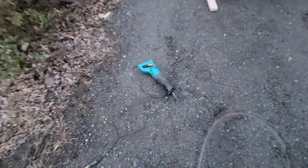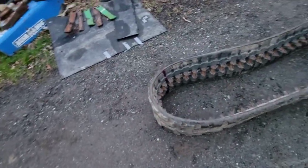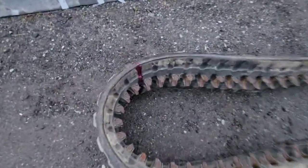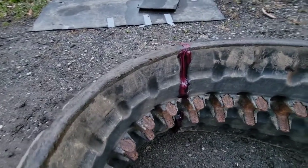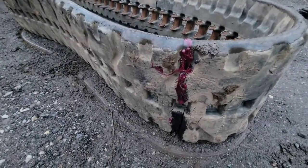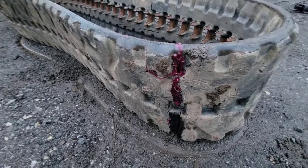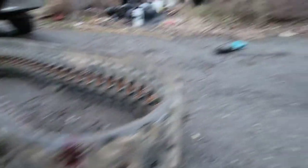To cut these things it's very easy — get yourself a sawzall, get yourself a metal blade. This one's 13 tooth per inch. Then get yourself some good old number two grease. You could probably use oil if you want. I just slather the grease where I'm going to make my cut on both sides. You can put it on the blade but it gets so hot that it just melts the grease right off or burns it off — smoky, messy, disgusting.